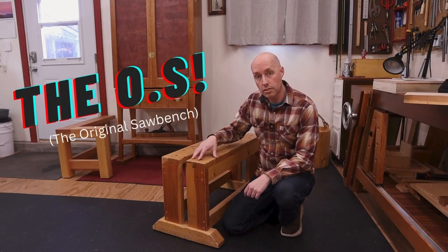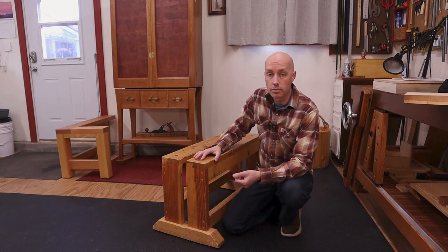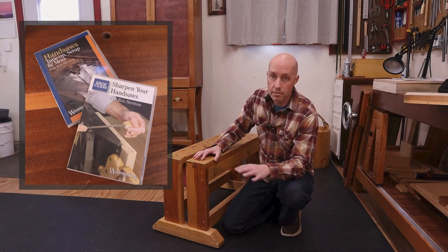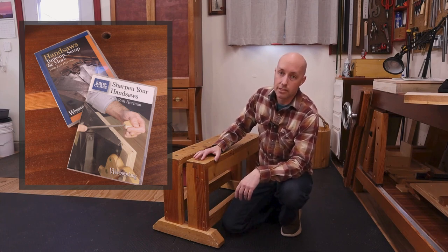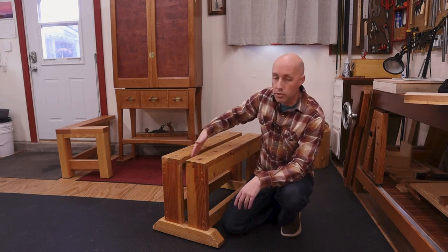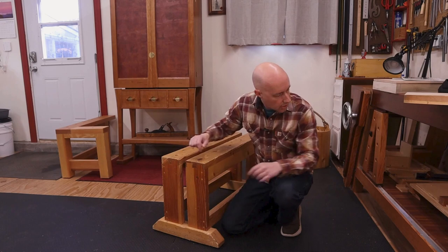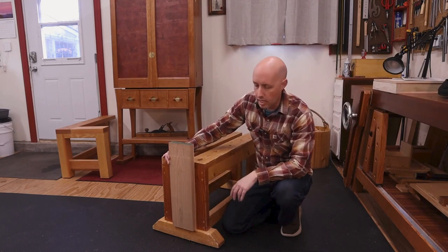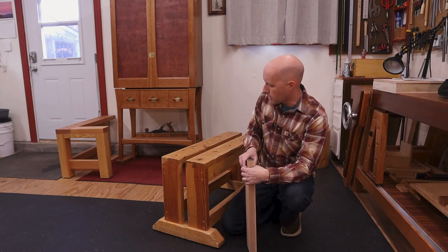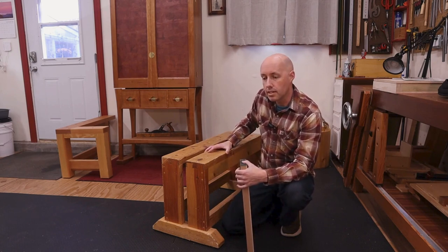This is my old saw bench — my original saw bench, the first one I ever built. I've used it for years and it's got the battle scars to prove it. It's based on a design by Ron Herman, who is known for restoration work. He produced DVDs about how to sharpen hand saws and use them, and they're fantastic — I highly recommend the sharpening video if you can track it down. This saw bench is a split-top design, where you can use the split to do rip cuts. It has big wide feet on each end for stability, a little ledge on the end for clamping and sawing, and it's solid enough for mortising on top. It has a row of dog holes down each side to hold your work. It's a good design, but there were things about it I didn't like.